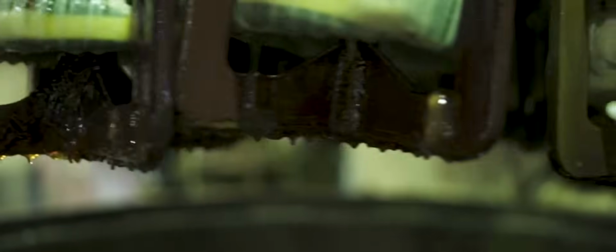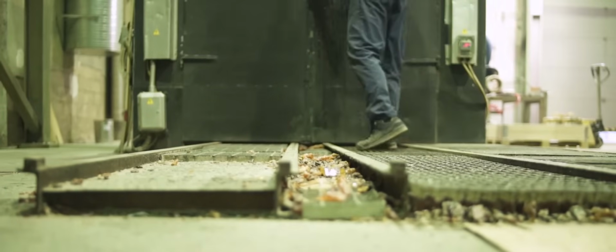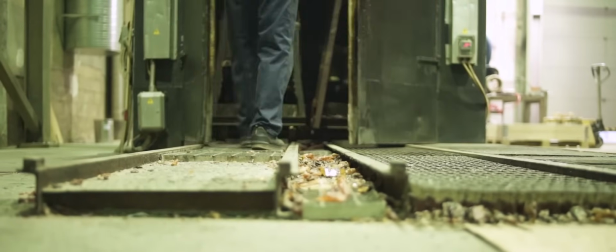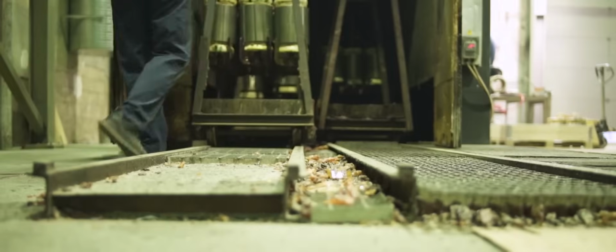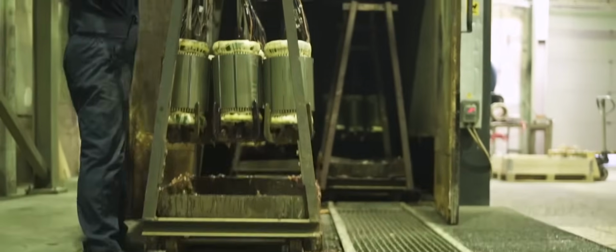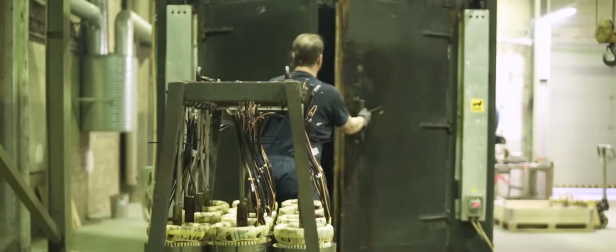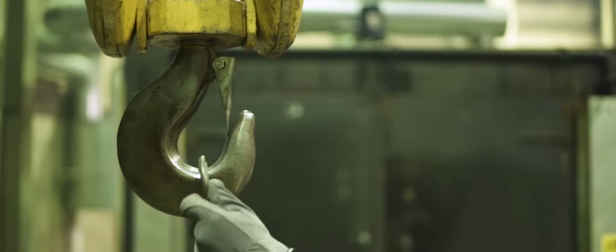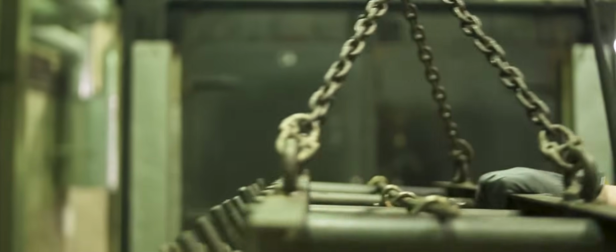Impregnated stators are left to drip dry and thereafter thermally processed. Applied heat will turn resin-covered windings into a solid monolithic structure. This results in greater durability, increased safety, and a longer lifespan, as impregnated windings have better thermal conductivity and dielectric strength. Properly impregnated stators also require a lot less maintenance.